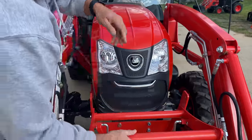Or at least it's something interesting. We could not get one of these tractors started at one point. It would not turn on. And this system is smart enough, or maybe annoying enough with safety stuff, to know that if it's in the split brake mode and you only press one of them down, it won't start. It actually has a little split brake symbol that shows up on there. So lock those together and push it and put it in neutral before you start it.